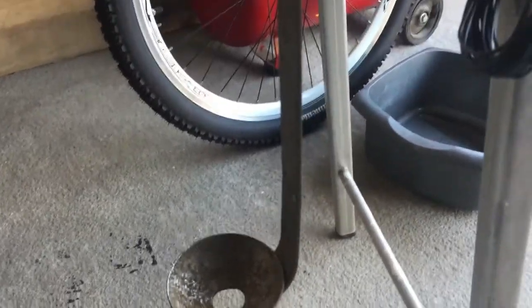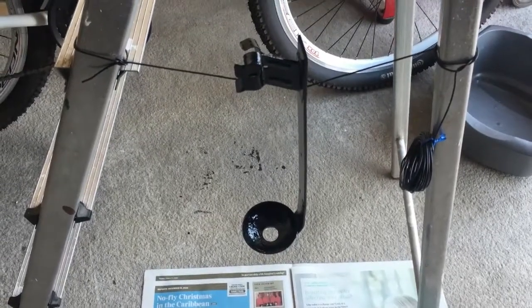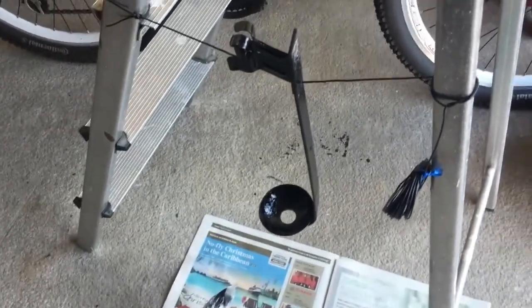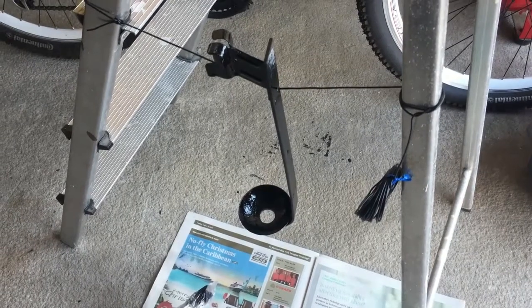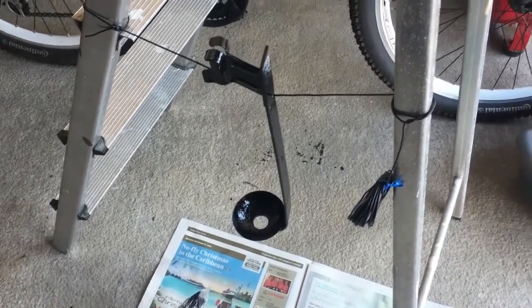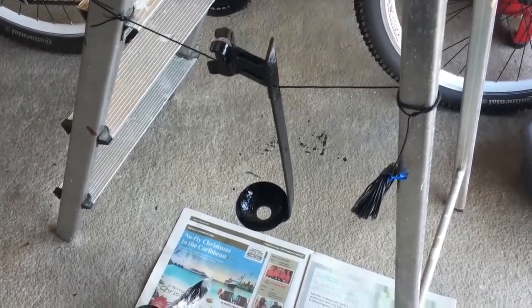So I'm going to start treating this with Hammerite and see how it comes out. The Hammerite has freshened that up. I'll take a second coat — it has to be done within eight hours, but I'll leave it a few hours before getting the second coat done to make sure the first coat is reasonably well dry, but not allowed to fully cure before the second coat.